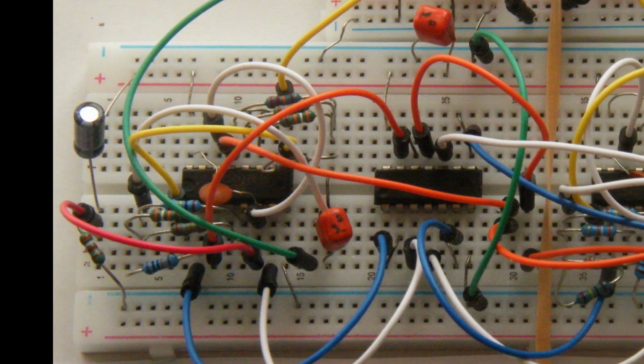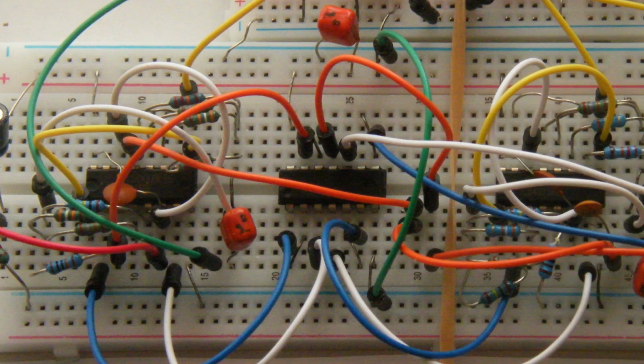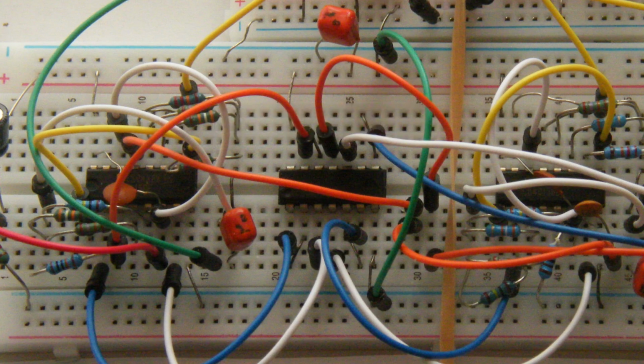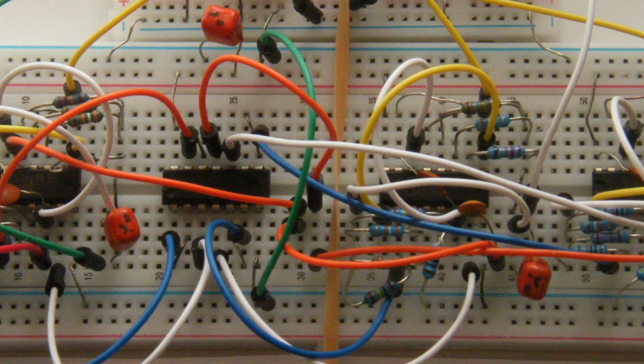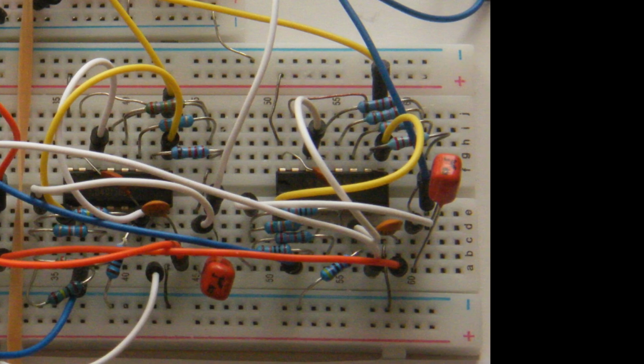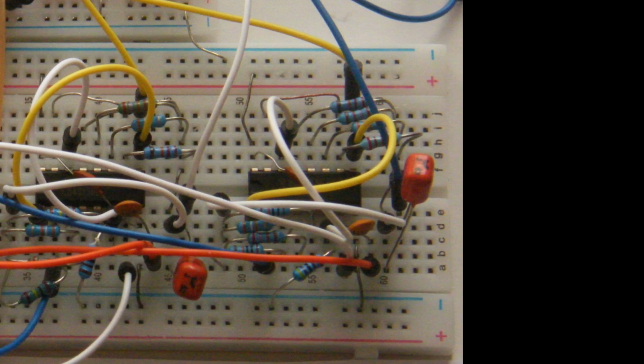Moving over to the right, the next chip, we have a quad NOR gate package that's been converted to 4 inverters. Then moving over to the third chip from the left hand side, we have the phase 2 synthesized sine wave generator. Then next to it on the far right, we have the third and final sine wave generator. By the way, all CD4015s are configured to be a twisted ring type counter.